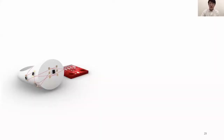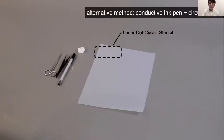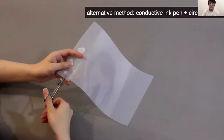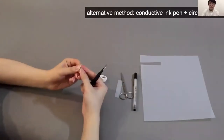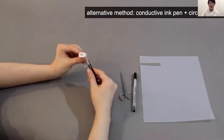If you want to go even further — for even smaller and complex geometry designs like a ring design, or some dedicated component and sensing layout like a teapot where we only want to sense data at the handle — MorphSensor provides an alternative fabrication method with a conductive ink pen and circuit stencil to accommodate these more complex geometries and designs like sharp edges and doubly curved surfaces. We first laser cut the exported SVG file into a circuit stencil, then use it to directly draw the circuit on the object. We attach the components with BigFoot onto the drawn circuit. This method requires more labor but offers more complex design capability — it's a trade-off between the two application methods.